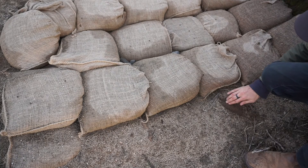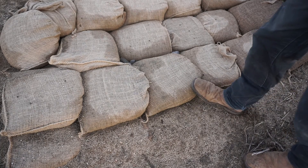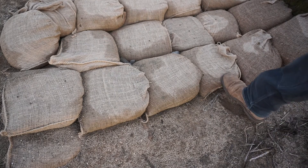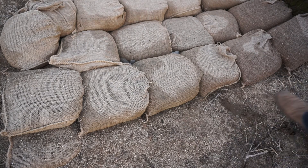In our splash apron, I can just push down and it's got a lot of give to it. The splash apron is going to get compromised over time as the burlap unravels. So basically what needs to happen is this needs to get torn out, remixed with fresh cement, and rebuilt — this splash apron down below.